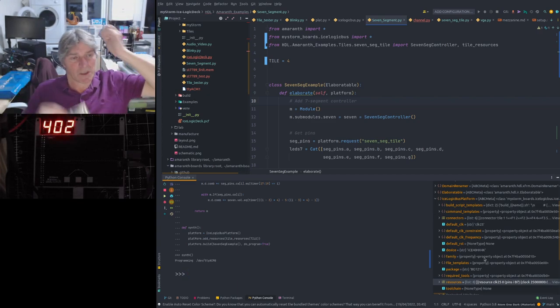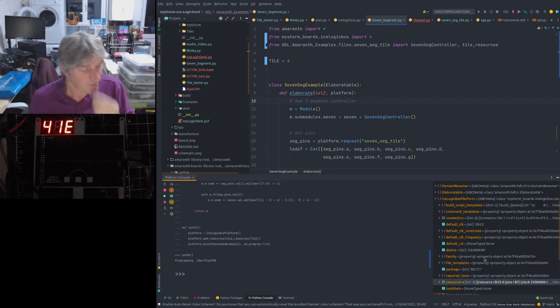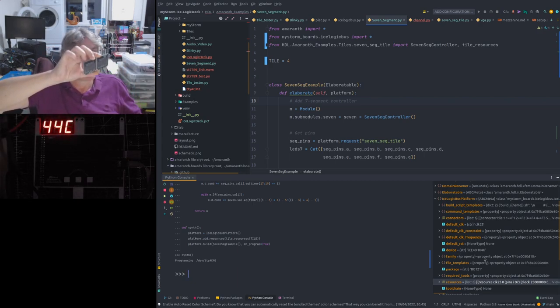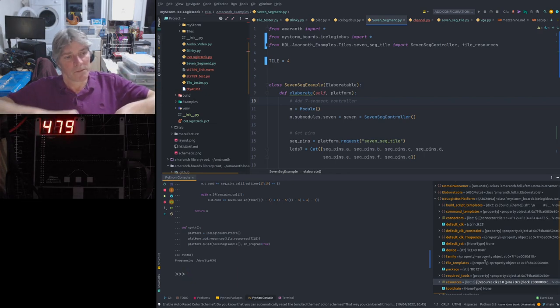So my thinking here is, what I could do is pre-reflow these with the male connectors, then after I've populated the ICE logic board with everything other than the tile female connectors, I take two of these pre-populated with the males, and I fit onto the males a female on each one. I have two of these, and then I put that onto the board with spacers, metal ones, not nylon ones, because they'd melt in the reflow process, put those on top, screw them down onto the board, and turn it back over.